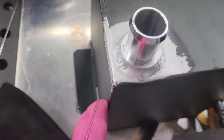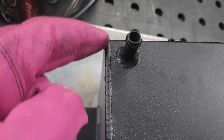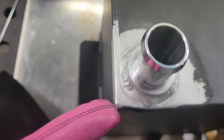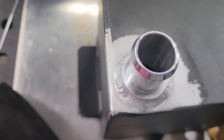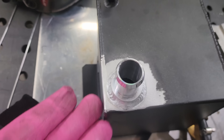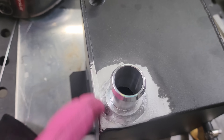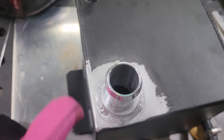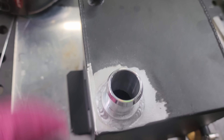Now for an additional entry here, I'm going to weld this seam back up. The only thing I don't like about it is the welds all went in this direction, and I'm only going to weld from here up to there. We just want to make sure that when the customer ground all that down, he didn't weaken the side of the tank. So just a quick bead to dab that back up there, and this job is done.